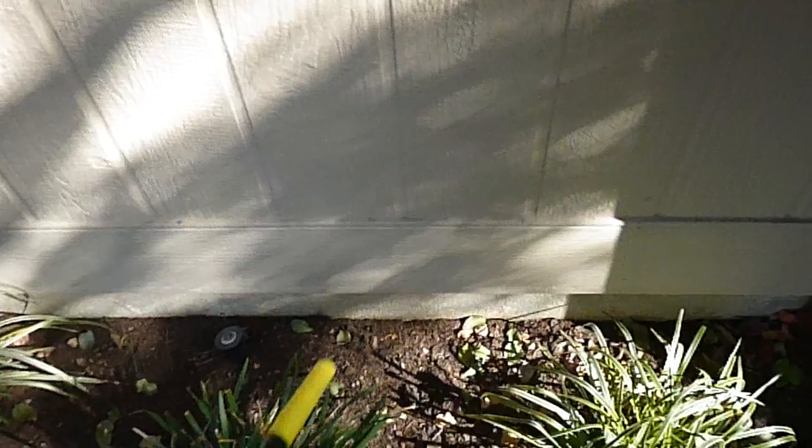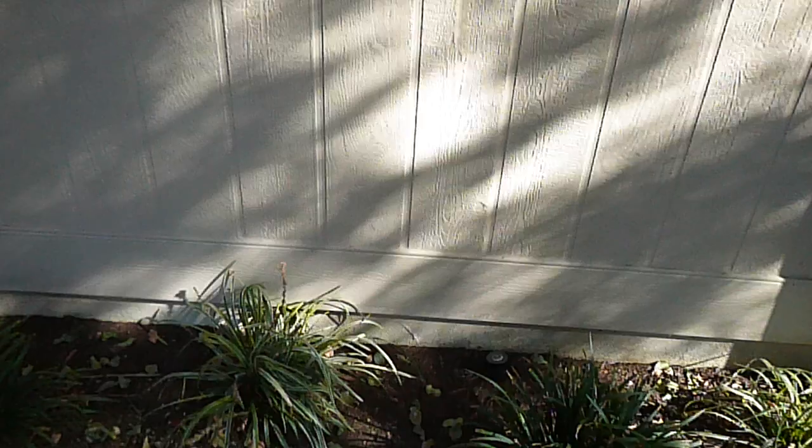This is the fence — the only fence I'm aware of to the backyard. Lawn sprinkler heads should not be closer than 12 inches to the structure, and the mulch is too close to the house. When they have these horizontal trim boards at the bottom of the paneling, that's not how it was originally installed — there's been some wood damage behind there and they made a nice little fix.